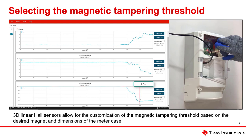In the right picture, you see a magnet applied to an electricity meter in an attempt to steal electricity. To the left, you see the resulting magnetic flux density readings from a 3D linear hall sensor. The sensed magnetic flux densities of the X, Y, and Z hall axes are shown. Since the magnet is in the Z orientation and the case dimensions lead to a small distance from the magnet to the hall sensor, a large magnetic flux density of about 100 mT is seen at the Z axis. Due to 3D linear hall sensors providing information on the actual sensed magnetic flux density value, the magnetic tampering threshold of each axis can be selected to anything within the magnetic sensing range of the 3D linear hall sensor.